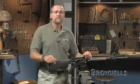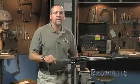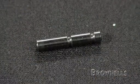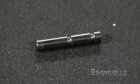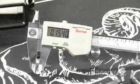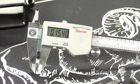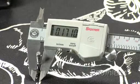There are two standard sizes of trigger pins available for the AR-15. The trigger and hammer pins retain and act as the shafts on which the hammer and trigger operate. Both the trigger pin and the hammer pin will be the same size. Some manufacturers use specific sizes that you should be aware of. The most common pin size is 154 thousandths, found on most military and civilian rifles. The other size is 171 thousandths, which is found in Colt Sporter rifles.